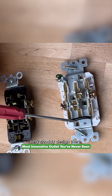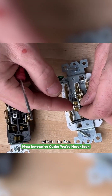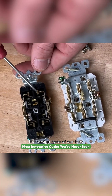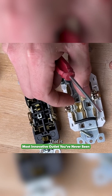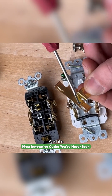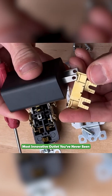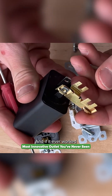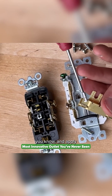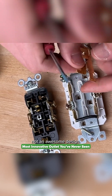To me that's a very shoddy design — not loving that. The neutrals are also internal. It does have a back-wiring feature with screw terminal plates, which I do like, but the contact tabs that hold a plug in place are concerning. The neutral contacts are just set at a fixed distance with no spring force — you simply pass the plug in, and if it ever works loose, it becomes a loose outlet quickly. There's no spring capability to apply pressure to the prong. It's essentially a static gap, which is not a great design.